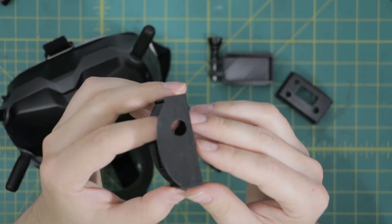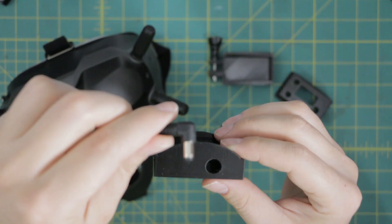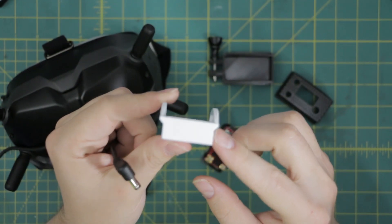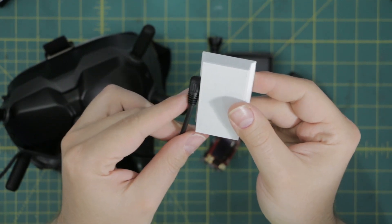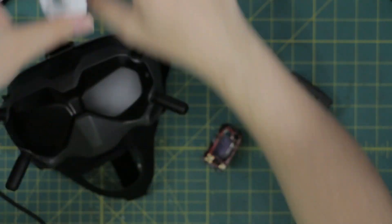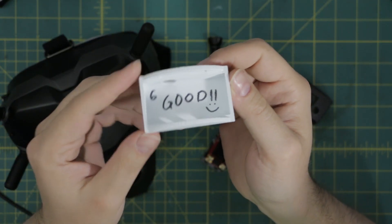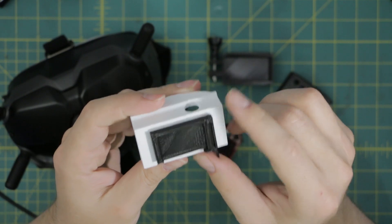The first step was just slimming it down. I found out pretty quickly that the original design with the way these angled connectors plug into it — they would plug in but not far enough. So I went to reducing the edges from the outside so that when you plug these in they would go in more snugly and actually complete the full connector. There was a lot of going through and redesigning — bad holes, still bad holes. Finally version six was good, and that's when I started experimenting with how to actually mount it to the side of the goggles.